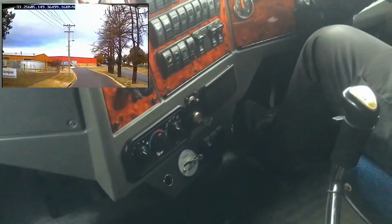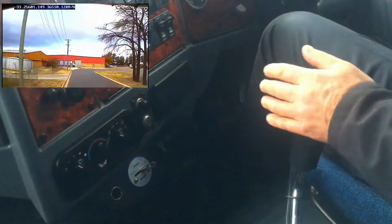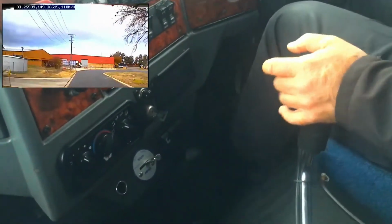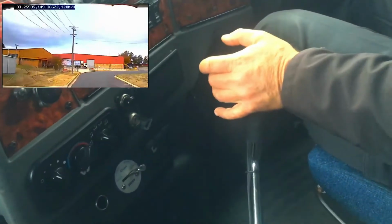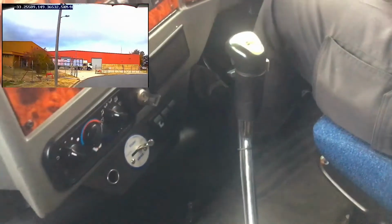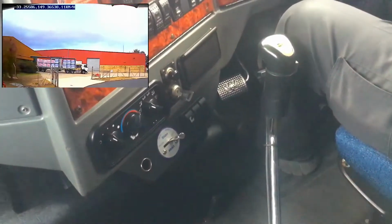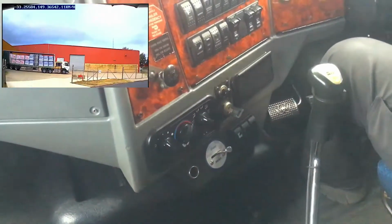Now, if you make a mistake with the gear and you don't double clutch correctly, the gearbox will grind. It won't go into gear until the gear change is double clutched and re-revved to go into gear. So the gearbox has to be perfectly changed or it will grind quite badly.